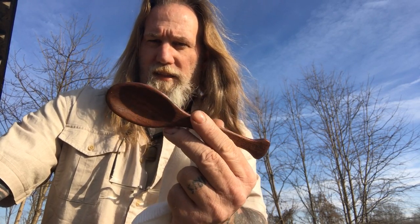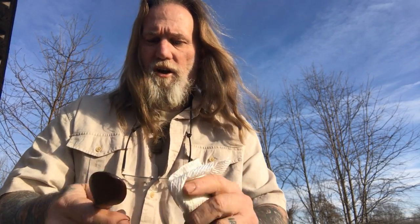If you take green wood into a house with central heat and air — which dehumidifies your house — it's going to split and crack fairly quickly. If you're using reclaimed or kiln-dried lumber yard wood, it's probably not going to crack and you don't have to worry about it. This walnut spoon — once I get it oiled up and it's soaked in all the oil it's going to take, it's good to go and I won't have to worry about where I store it. Those were just a couple quick tips and tricks on carving spoons and general questions from my previous carving videos.